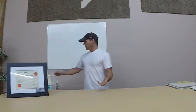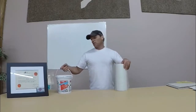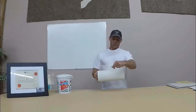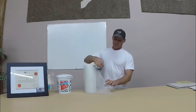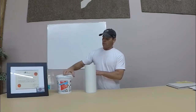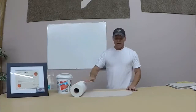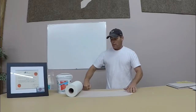If you do have any cracks in your concrete floor, I would suggest using the HPG product — it's probably one of the cheaper brands. You don't have to do the whole floor, just get where the cracks are. Always remember — this I believe is a 12-inch fiberglass mesh — you always want to make sure you get 6 inches on either side of that crack for good strong support. You can just use a trowel and trowel-apply this over the fiberglass mesh. Make sure it's covered, nice and clean and flat — you don't want any ridges. Just scrape it off with your trowel, because when it's hard, it's hard to scrape off once it's dry.